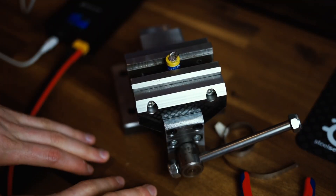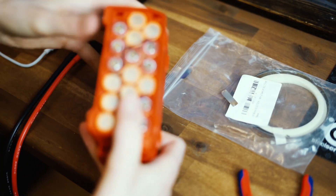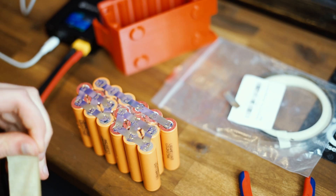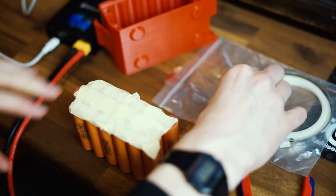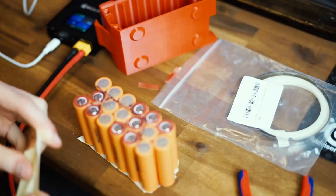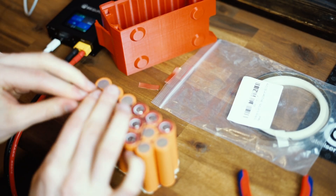Let's get the actual battery in here. What I would always do — this is really dangerous to work on — is put some sticky tape on the back side, just go like this and put it on here. Now when you, for example, leave something on here and you accidentally put your battery on there, it's not going to short circuit immediately. So I would always get some tape and put it over each of these contact areas.